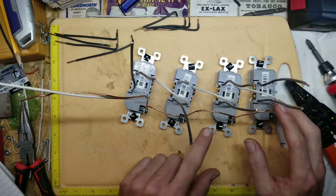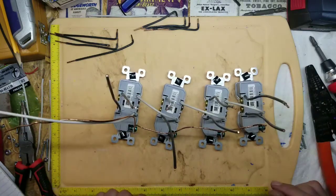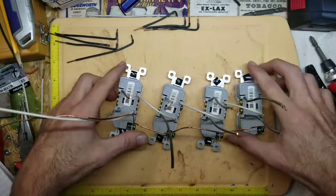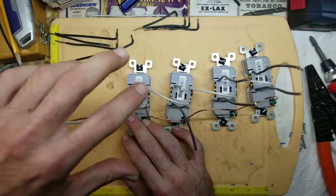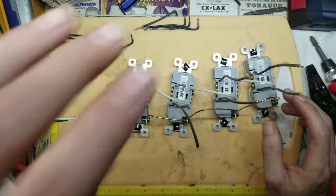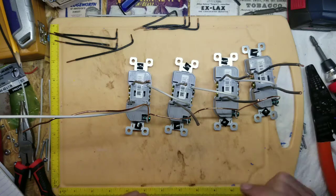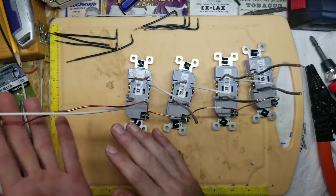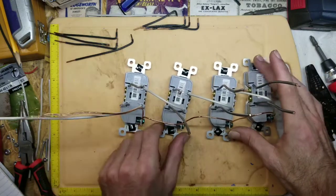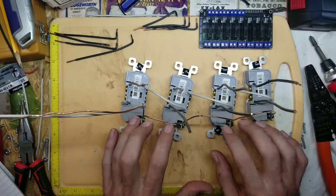The ground wire is all connected. I used about 20 to 24 inches — I probably could have gone a little longer for more tag end. Quick recap: on top, your wires have about a half inch stripped and a quarter to five-sixteenths on top; all your top hot wires have the double insulation stripped off both sides, your bottom ones don't — you'll see why when we put them through the box. All your commons are connected, white wire goes outlet to outlet to outlet with a long pigtail, and the ground goes from ground screw to ground screw to a pigtail out the end. In the next video I'm going to show you how to mount the relay board and get these outlets installed.